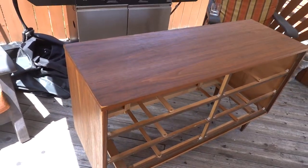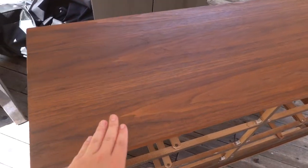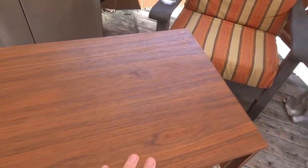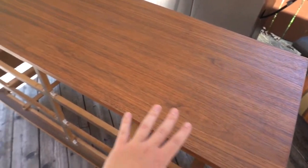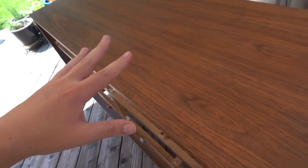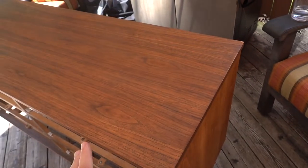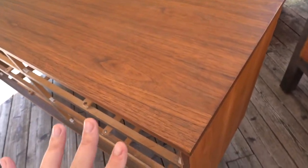I've applied all of the oil. You saw me apply the first layer of teak oil — I wiped that all down and then went over it with a layer of Danish oil, making sure to wipe it all away right away because I didn't want those weird spots when you look at it from the side where the product didn't sink in enough and dries really weirdly. So I just made sure to wipe it all away right away. It looks really really nice.